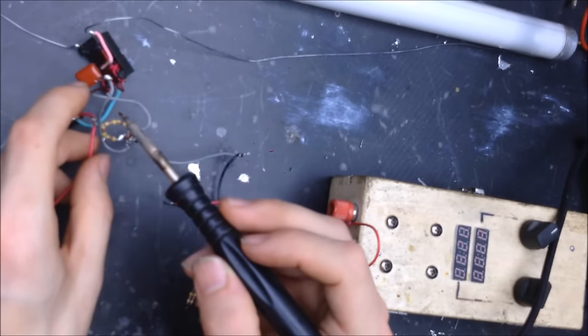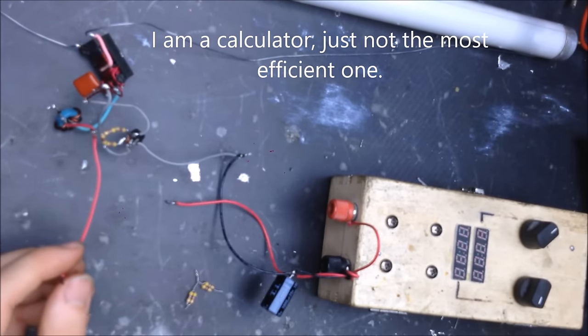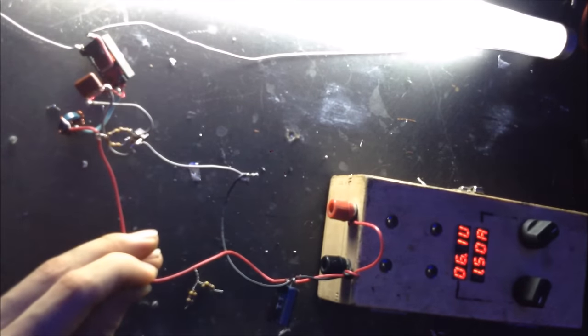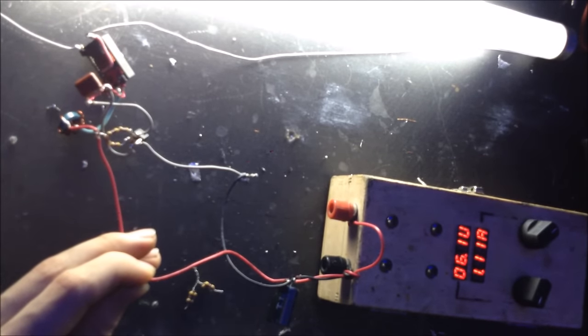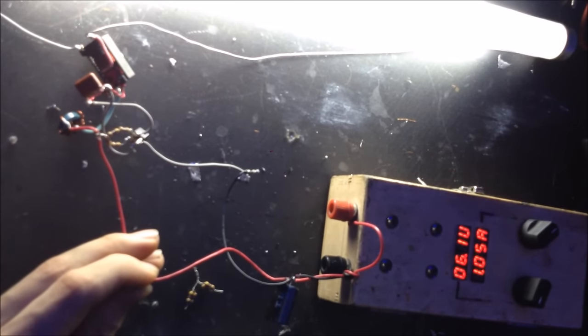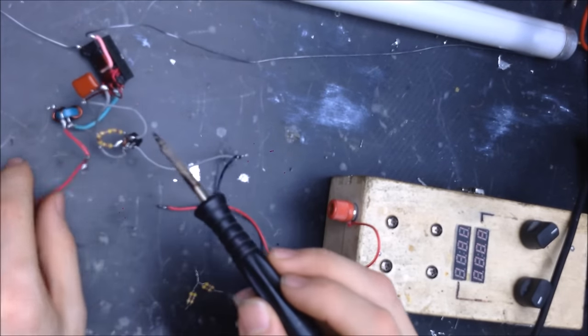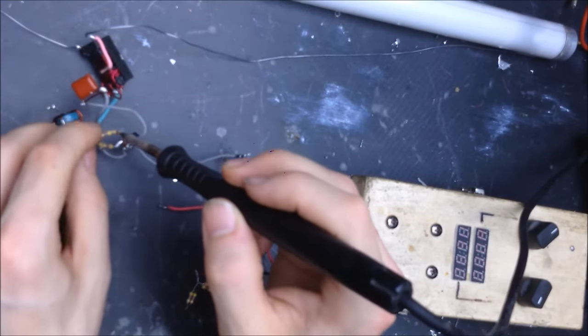I don't have a calculator right in front of me. But alright, so see what effect that had. So about 1 kilo ohm from about 500 ohms. So you can see we're drawing a little more current overall. So not so much of an on signal to those MOSFETs, meaning that they're probably not switching as hard as they could be. Meaning that there's a little bit more on-state resistance in the circuit.